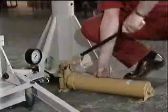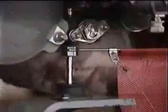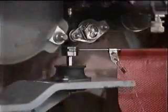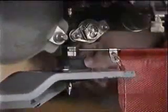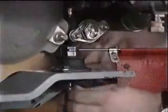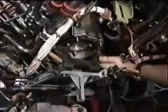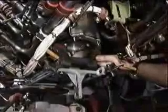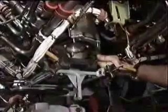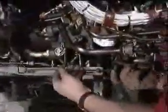Operate the hand pump to lift the gearbox adapter up to the gearbox, making sure that the handling pins pass through the rubber shock absorber bushes on the gearbox adapter. Then fit the safety pins through the handling pins. Ensure that the angle gearbox support is contacting the base of the angle gearbox. Fit the locking fixtures to the lugs on top of the angle gearbox and tighten the hand wheels.